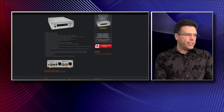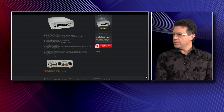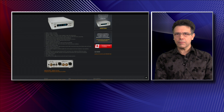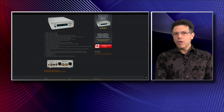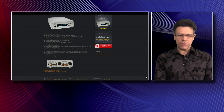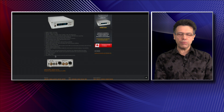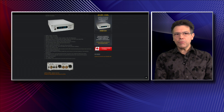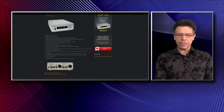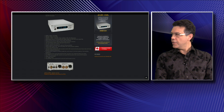We have 11 internal power cleaning stages — basically every circuit inside is powered separately with its own linear regulator. This ensures that one stage doesn't affect the other, which would interfere with the purity of sound. What happens is power consumption for one stage modulates the power of another stage and causes something called jitter — that's one of the sources of jitter problems. To minimize it, we use one of the best master clocks on the market. There are actually three clocks inside to provide precise timing — we use an 82 femtosecond clock, which is state of the art these days.